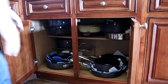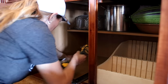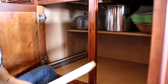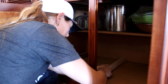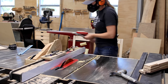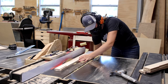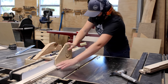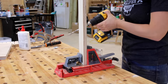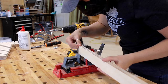Now let's install them in a cabinet. Every cabinet will be a little different, so even if you get the plans for this project, be sure to measure your exact opening before building. The main install process will remain the same though — you need to attach a runner to the left and right of the opening so the drawer can slide in and out, clearing the hinge, the middle stile, and maybe even the front lip of the face frame. I'm using some three-quarter inch plywood for my runners, cut from scraps. I used my Armor pocket hole jig to drill in a few pocket holes — the front location with the hole facing the short side to go into the face frame, and the back location facing the long side to go into the bottom of the cabinet.